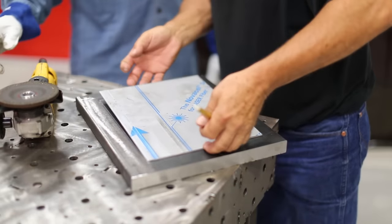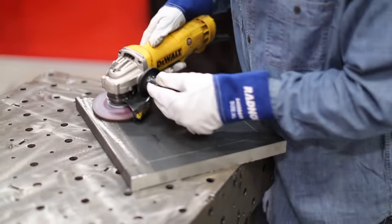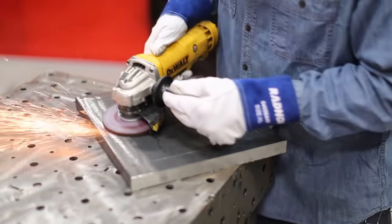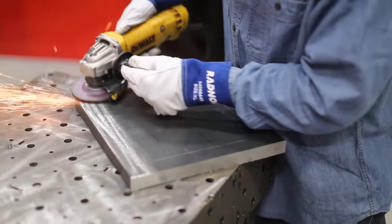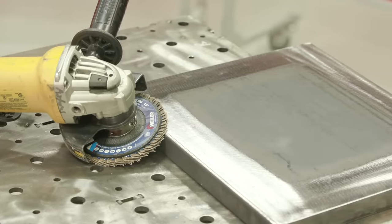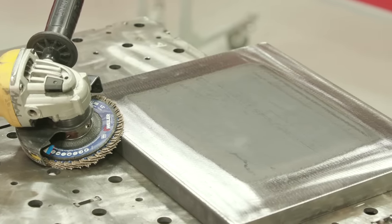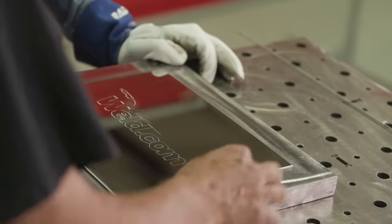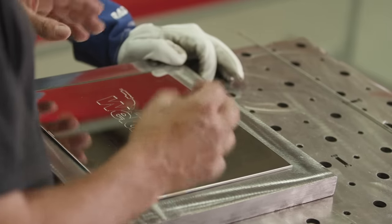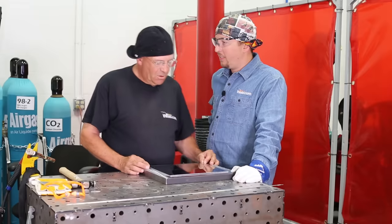That way I get a nice clean weld. With the mill scale on there, you can get a nasty, dirty pool around it that you'll pop. You'll blow tacks. So, nice clean perimeter. I'm going to lay probably little half-inch welds periodically around this. That's probably overkill. Skip weld around here to keep this thing. Probably overkill, but a little more is better than a little less.